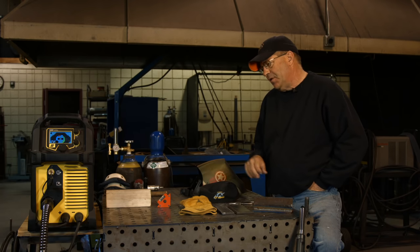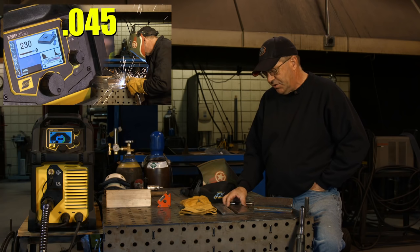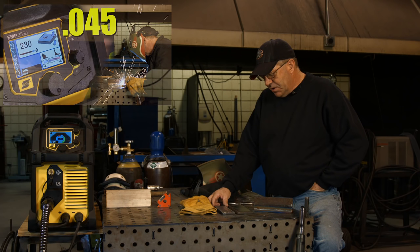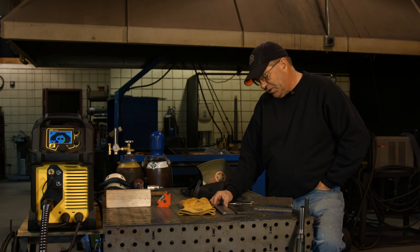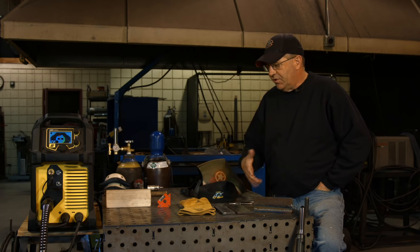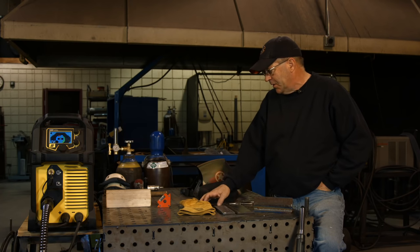I love the features and the versatility on this machine. What I was thinking about was, I think we did a video here recently where we switched over to .045 diameter wire and we were running C25 on the S-MIG program. I'm curious to see what's going to happen if I switch that over to 95/5 gas — 95% argon, 5% oxygen — which is something that we would normally spray with. I know the machine has guts enough to switch over and we'll spray with it. I haven't yet, but I'm just real confident that this machine will handle it, even on the .045 wire.